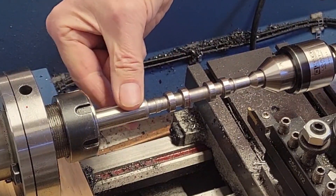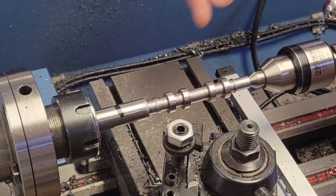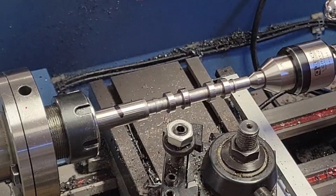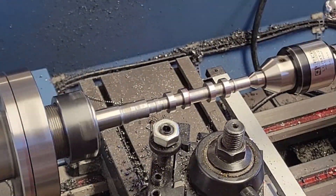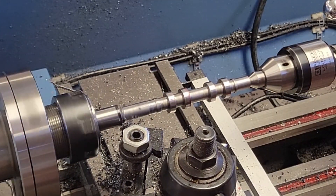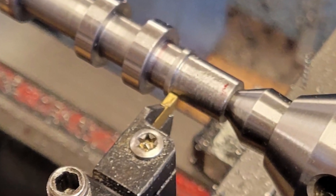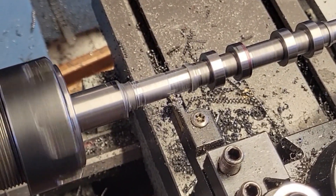Here's our setup for machining the front part of the camshaft. I put a live center in the back — I probably should have had a live center in from when I machined this area. The first order of business is to rough this end down to 0.4; everything underneath here is less than 0.4 inches. Carbide works best — it gives the best finish when you take a relatively aggressive cut. I'm using oil to keep the material cool; you can tell it's doing its job because the chips coming off are not discolored. As before, I finish up with a small cut and then a spring cut, then take my measurement to verify my DRO is still in calibration. I load up my parting tool to get that nice sharp edge against the bearing stop, touch off against the first bearing surface, and initialize my diameter on the DRO. This gets us in the ballpark, then I follow through with our plan and cut the three diameters on the front of our camshaft.